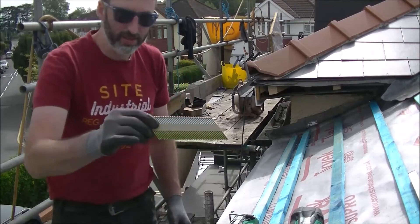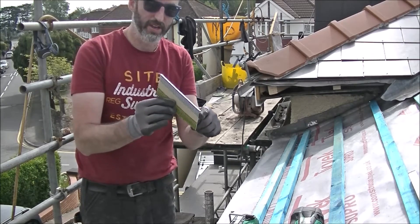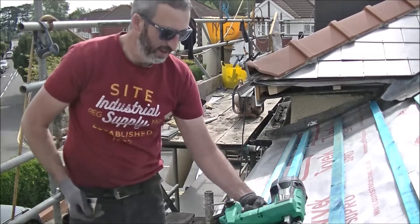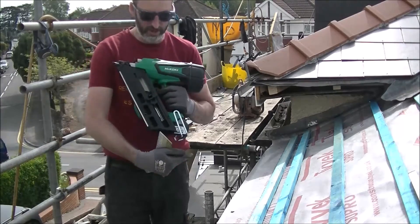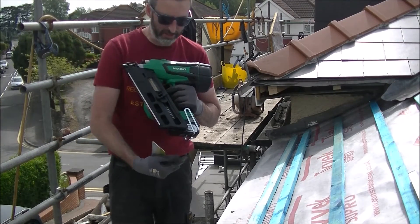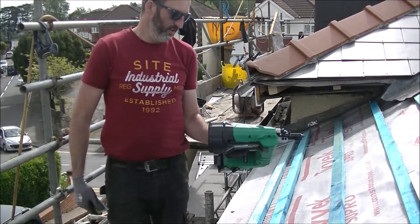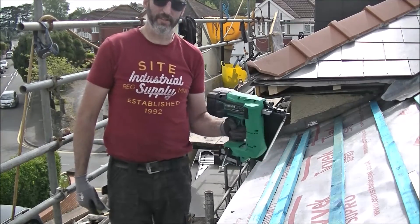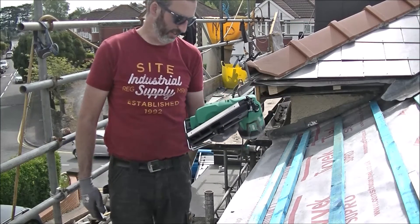This comes with what are called clip head nails, and you get a lot more nails into the cartridge. If you look at the one with the full head nail, the magazine runs out further past the gun, so there's more chance of damaging it — that's the one I've opted against. Shop around and you'll probably save yourself £200 or £300 on the retail price that some people are asking for it.